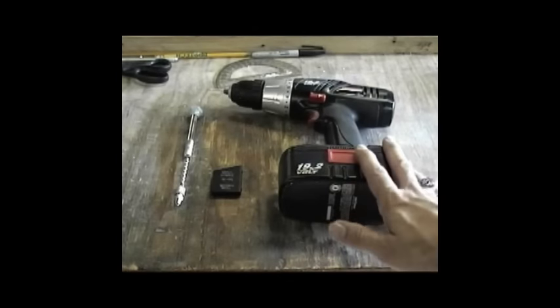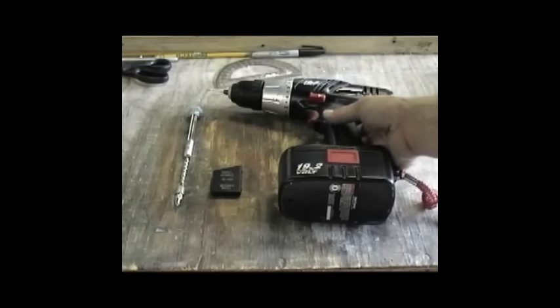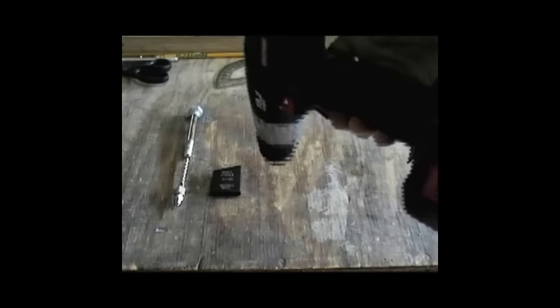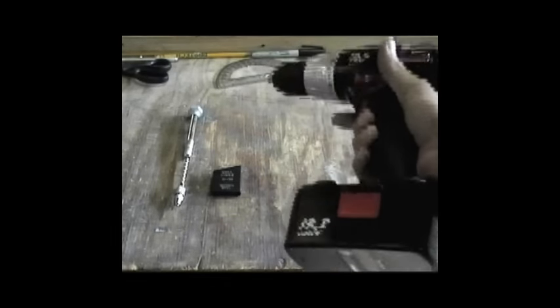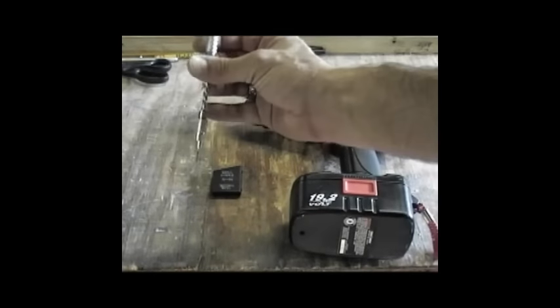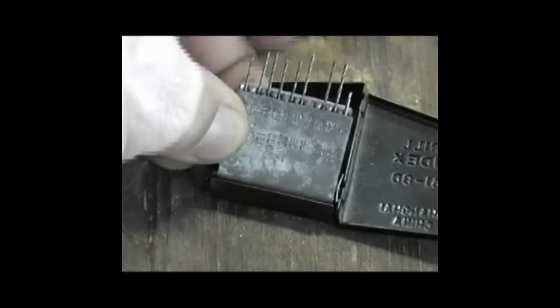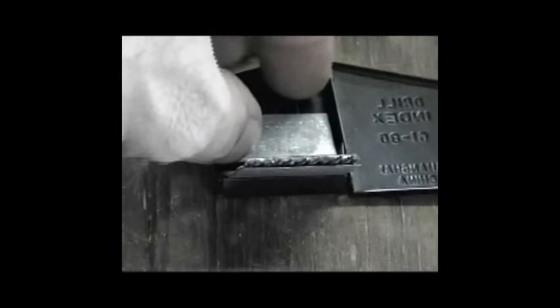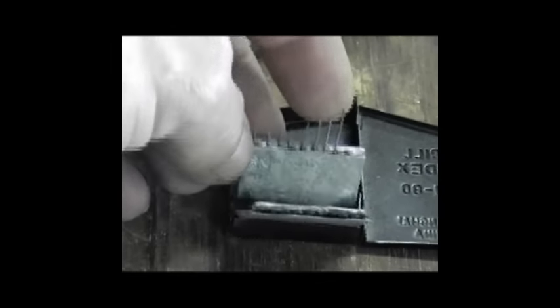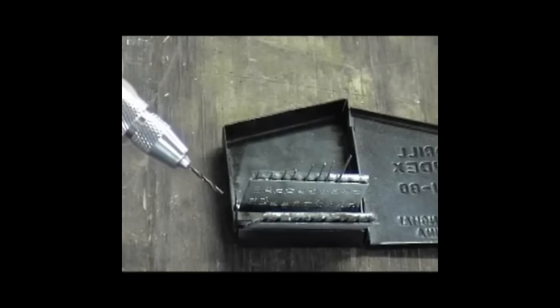Now, if you use a handheld power drill, you're not likely to get the hole a perfect 90 degrees. Now, this one helps a little bit because it does have the bubble on the back that lets you know when you're at 90 degrees, but it can be hard to hold. It's very bulky and cumbersome. This twist drill, that's another item I picked up from Wildwood, is very handy, and they also make the matching drill bits, which you can get an entire set. This is a 16-piece set here. A very small, tiny drill bits. These are very handy for those super small holes. When nothing else will work, you can go to this and it will do you a good job.